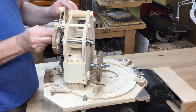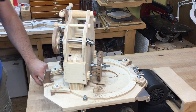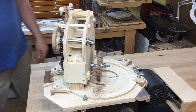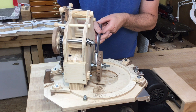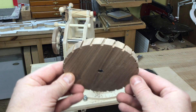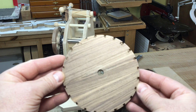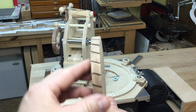I always disengage the pin mechanism just to avoid putting pressure on the sprocket, and then I can take the wheel off. I will still need to do some sanding on this, but that is some nice and accurate groove spacing. The real test, however, will come when I do the second one to see if it matches the first.